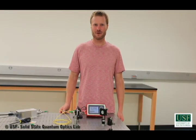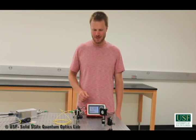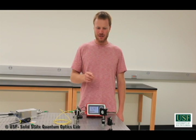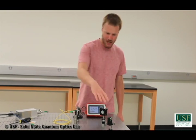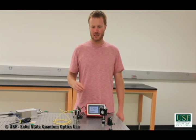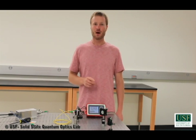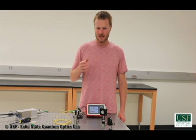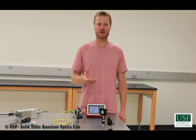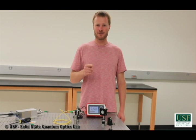I hope you found this demonstration very informative and helpful. Before I go, I want to give you some thoughts from doing this many times. First, the better you do the procedure and step you're on, the easier the next step will be — so if you align these well and square, it'll be easier to match the beams, and if you match the beams better, it'll be easier to walk the beams. Second, walking the beams can be very frustrating at first, but like riding a bicycle, if you just work on it, it'll become intuitive and you'll no longer need to think. And third, a good rule of thumb is to be able to couple at least 50% into the beam. Thank you for your time.